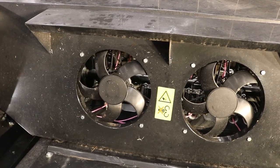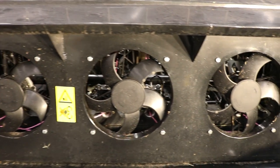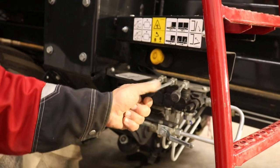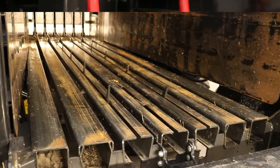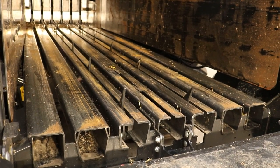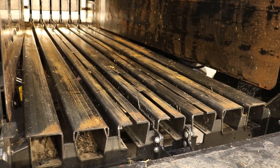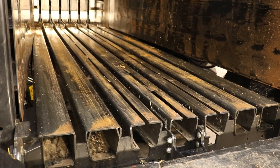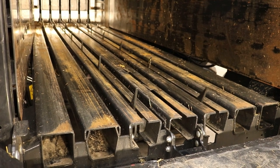Three cleaning fans ensure efficient knotter performance throughout long working days. At the finish of a field or crop type, any remaining bales in the chamber can easily be ejected by releasing the chamber pressure and using the hydraulic bale eject system. Tynes are moved from the chamber floor up into the base of the bale and push it down the chamber and out, allowing all crop to be left in the field whence it came.